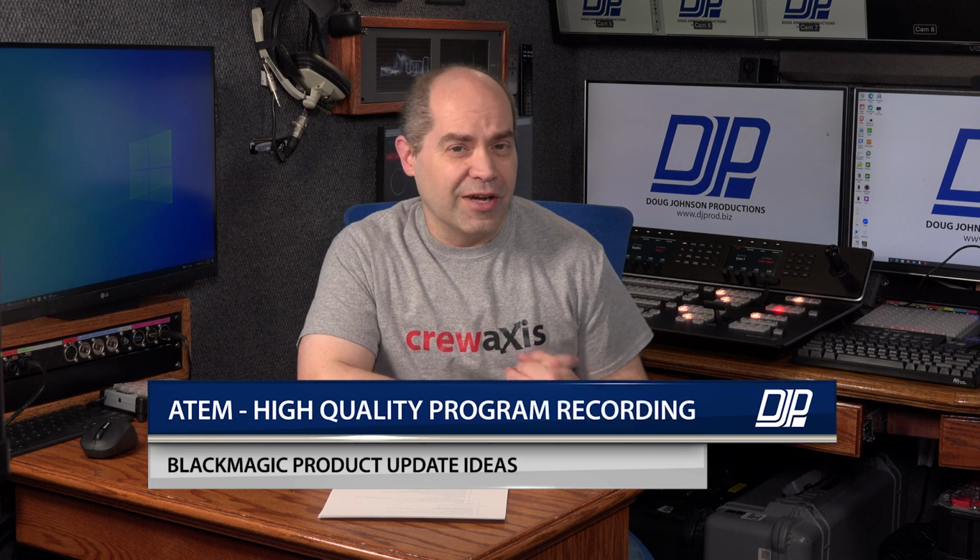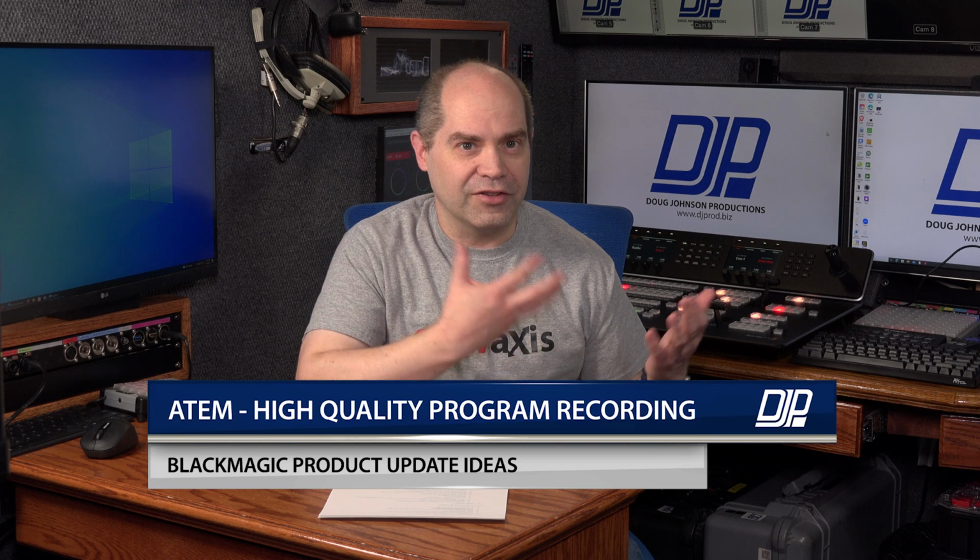So first of all, higher quality recording for the program output. So right now, when you go to live stream from an ATEM Mini or ATEM Extreme or even Television Studio HD8, the program recording is at the same bit rate as you happen to be streaming, which probably means that it's lower than what you would hope to have from a master high quality recording, which therefore means if you want a high quality recording, you're hooking up another external device, a recorder of some kind, probably a HyperDeck, in order to record that signal.